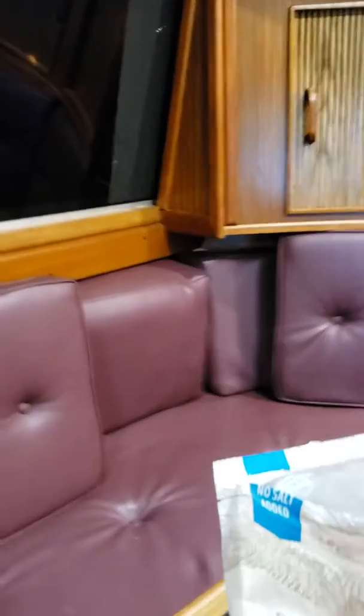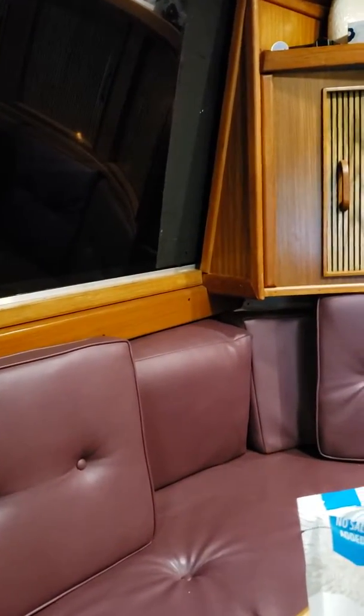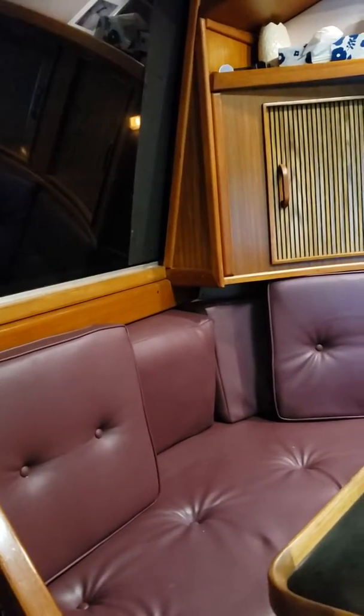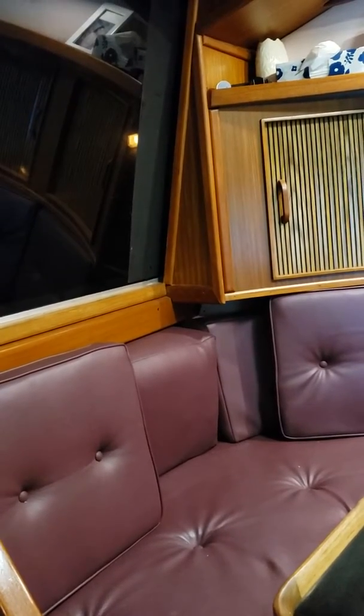Right. Yeah, I agree with that. Up here, I'm not so sure what the value would be, but down here, I agree with you on that. Well, the value here would be you need something to screw this C-channel in once you rotate it. If you don't rotate it, you shim it, you don't need it. But that's here or there. Down here, you definitely need it. Up here, if you rotate it, you definitely need it.